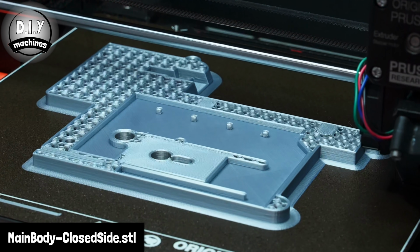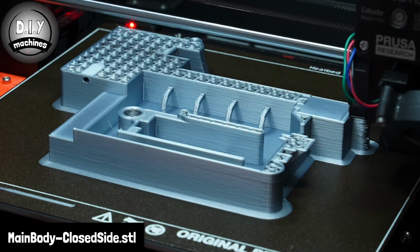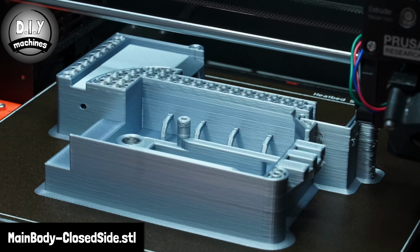The first part that you'll need to print for this project is called Main Body Closed Side. You'll find a link to all of the 3D printable models in the description below. I printed mine at a layer height of 0.3mm and used a 0.6mm nozzle to help reduce my print time. There is no need for supports on this part.